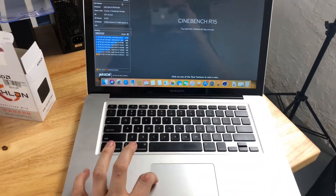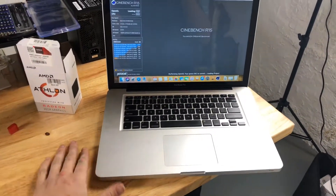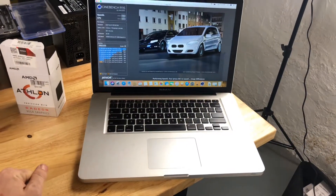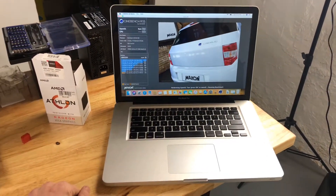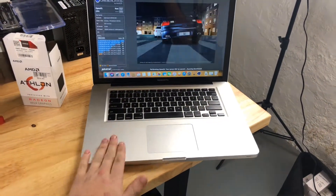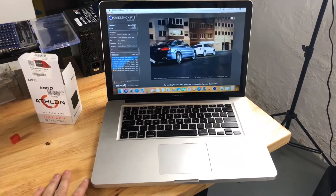Here she is. It did actually seem to work. The thing now boots into the dedicated graphics without an issue. When I open and run Cinebench, we're actually getting something now, which is pretty impressive on the OpenGL test. It's not great performance, but again, this is a 10-year-old laptop, so I'm not expecting the world out of it. The oven has fixed another MacBook — this time an NVIDIA. I really thought these were going to be ATI, but apparently that was 2011. Good old oven trick. Just make sure you do 425 instead of 350, because apparently that extra bit of temperature really makes all the difference for solder beads.